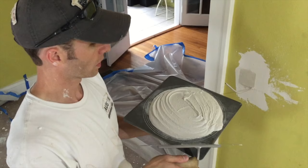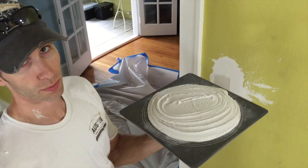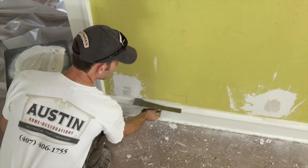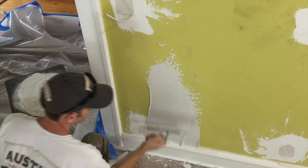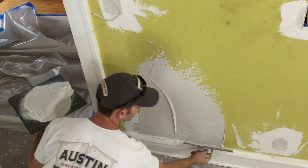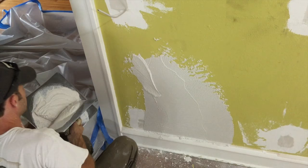We're going to start applying it. Like the plaster, you can see it's a little runny — that makes it easier to put it on. It's so much easier on your shoulder if it's runny. If it's thick, it's going to wear you out and set up fast. So you're just going to load it onto your hawk, onto your trowel, and start applying with the mix. I'll do it slowly so you can see — put it on like that, and then slowly spread it out a little bit.